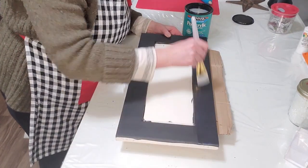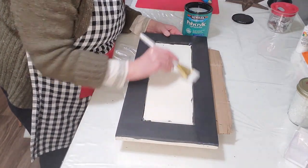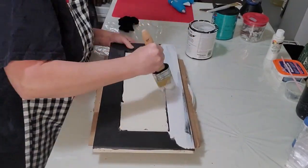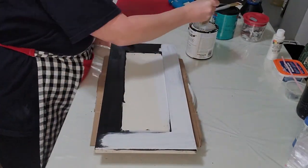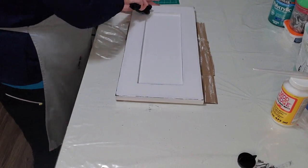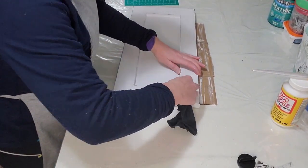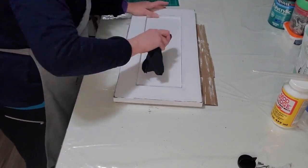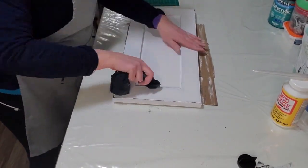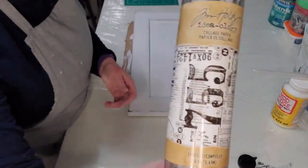And this is just a black interior paint that I'm using here. And after the black paint was dry, I put a polyacrylic on top of that because when I distress it back, I don't want it to just distress back to the cupboard. So I'm just sealing in that black paint. So I've applied my Rust-Oleum white linen chalk paint here. And right here, you'll see me doing some distressing along the edges and the corners just to give it that natural distressed look. And that's what it looks like when I've distressed it back to the black.